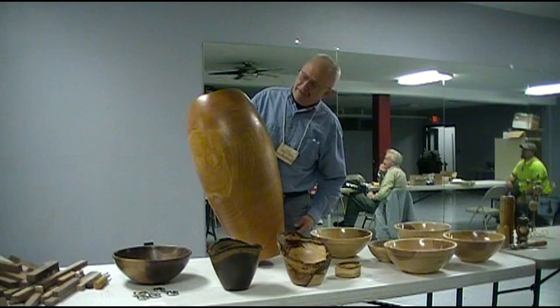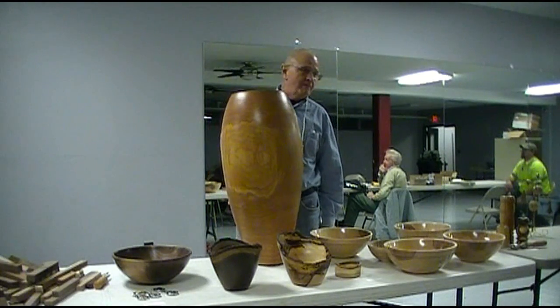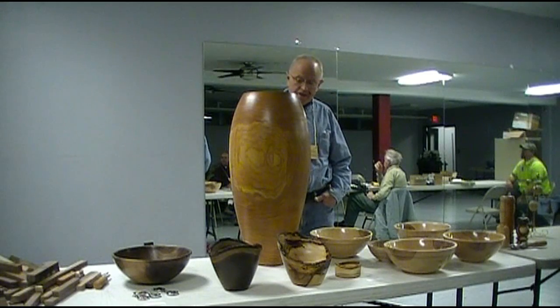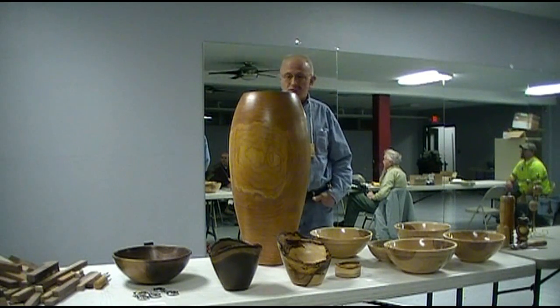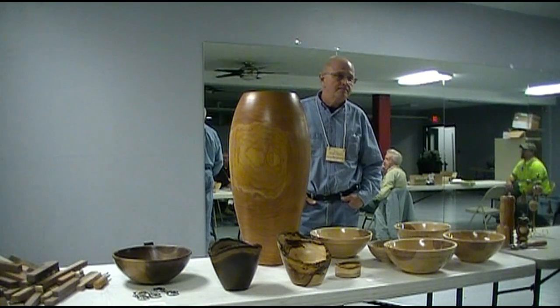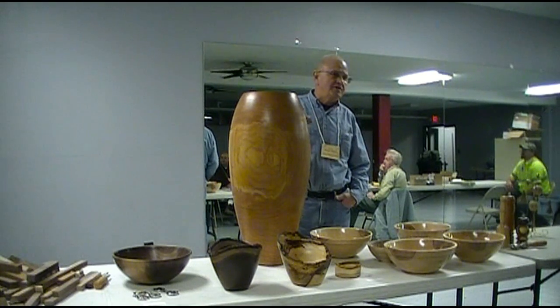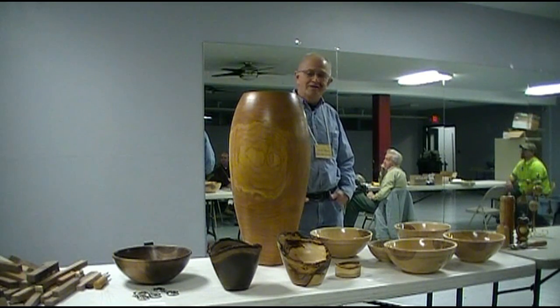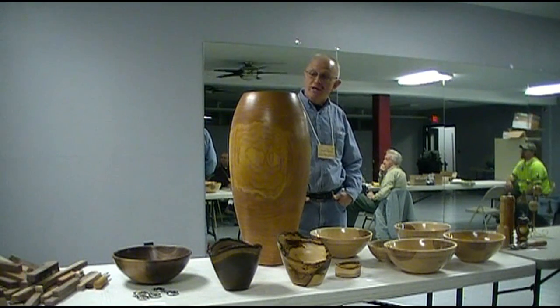And this thing I finally finished up. It's been sitting around for 5 or 6 months drying, and I got it done sanding and put back. I'll put some finish on it. All this stuff is just spray lacquer. I brushed a couple coats on the big stuff because it'd take a couple cans to shoot that thing otherwise, and then the last few coats I spray on.